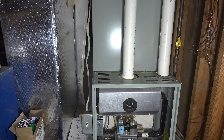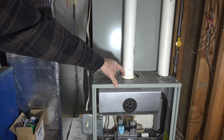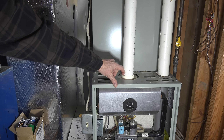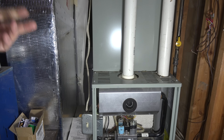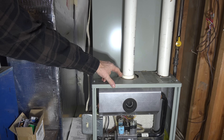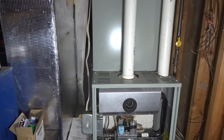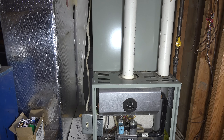I'm going to lift this off and see if any crap is in here. Maybe something came through the pipe — could be leaves, could be a mouse that decided to come in there and live and dumped a bunch of debris down there. There's a screen underneath here and you can look in there and see if there's a problem. Same thing here on the venting pipe — you can pull that out and do the same thing.